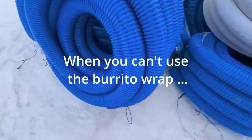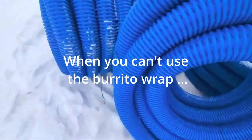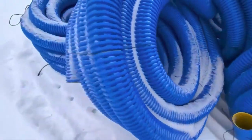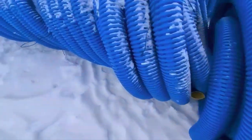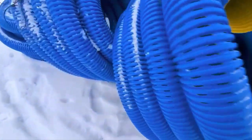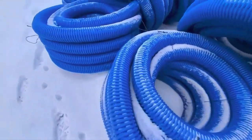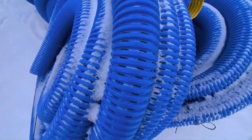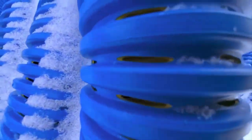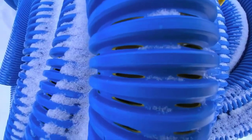I had a family with a small farm reach out to me and they said they want to use high octane on their farm. It was a couple acres, and they were going to follow Boffman Tile Company's recommendations that this pipe has to be set in by hand — because when Boffman Tile built the high octane, they opened it up to over 17 square inches per linear foot of inlet. Look at these inlets — over 17 square inches per linear foot of inlet.